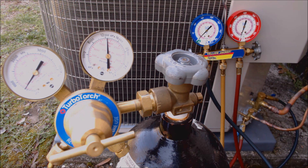Because especially when working on existing systems with lower pressure refrigerants, you could cause a leak if you pressure test too high. If the indoor evaporator coil does not have a max design pressure on the rating plate — or the rating plate is worn off or gone — if it's an older R22 coil, I would not pressurize it any higher than 150 PSIG. I've seen R22 evaporator coil rating plates as low as 150 PSIG max design pressure. Some old evaporator coils were made for AC only and some for heat pumps; the heat pump ones have higher max design pressures. Nowadays all evaporator coils typically have higher max design pressures — number one because heat pumps can be installed, and number two because of the higher pressure R410A refrigerant.